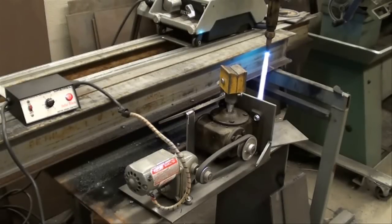Alright, here's another circle cutter I devised, and it's been a bit of a failure, but I'm going to show it to you anyway. The failure lies in that little motor, which isn't a true DC motor — it's a universal motor. I need a DC motor, but they cost too much. So it's real hard to regulate the speed, and the speed fluctuates a little bit. I think you can even hear it doing that.